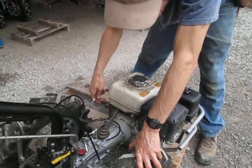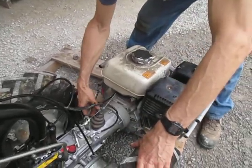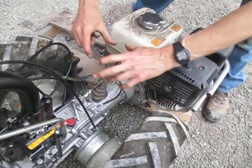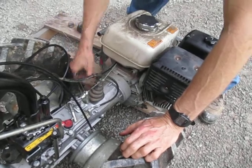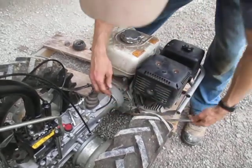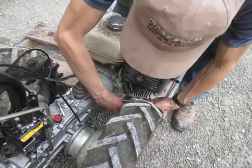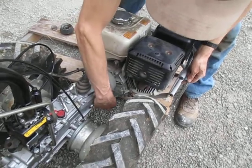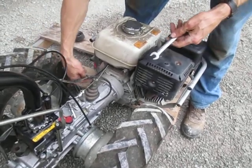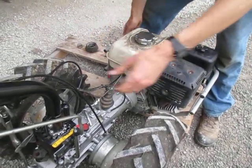So we're going to take off our engine mounting nuts. I've already taken some of them off just to speed up the video a little bit — there's just two left. If you've got an electric start tractor, these nuts are going to be kind of hidden under the battery support, so you may need to remove that battery support first — it's like three bolts to get it off. Take off your battery cables: always remove the negative first, then the positive, so you're not accidentally grounding things out. Remove the battery, then the battery support. If you've got a long socket with a universal joint, you can sneak in under the battery support without taking it off. But if all you've got is a wrench, you probably want to get that battery support out of the way.